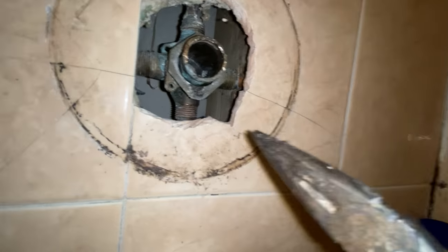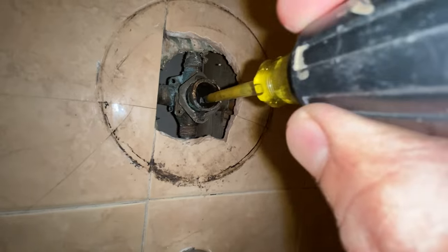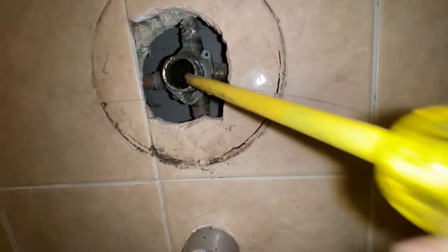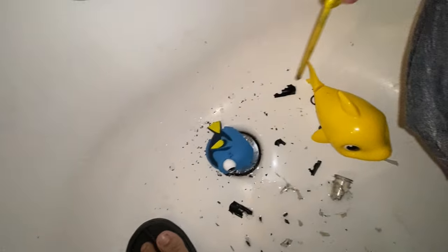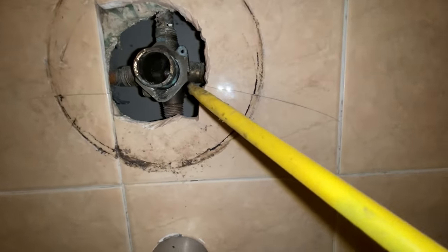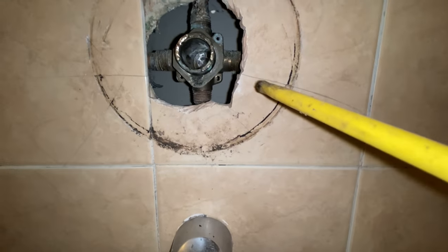Make sure there's nothing left. What happens is the rubber that's holding the water — right from here and right from here — these two rubber pieces cause corrosion and they get stuck, stopping the entire cartridge from coming out.